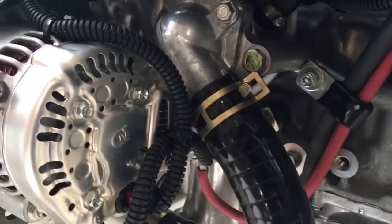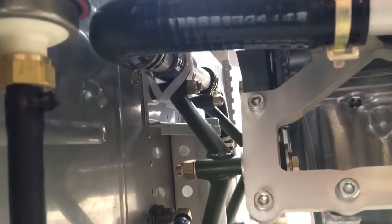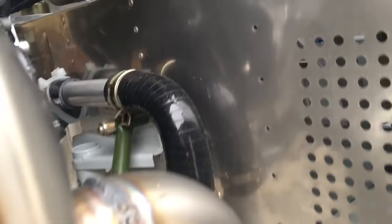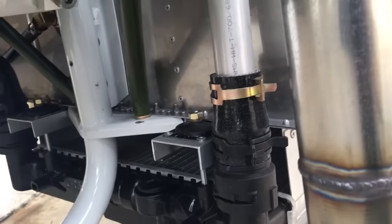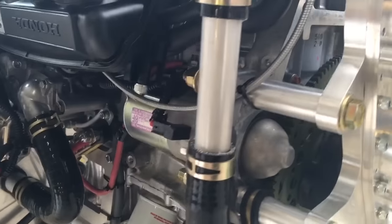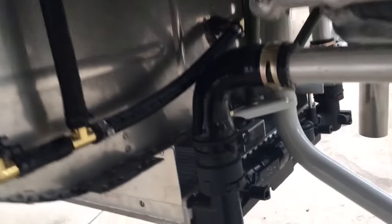For the cooling system, you're going to be coming out of your thermostat housing with a 135-degree elbow, a little piece of aluminum tubing barbed, then a 90, and going behind the engine but right on top of the engine mount. That's one side of the radiator, basically — coming across the top there. Then we make another 90 and go right into the radiator on this side. The other side is the hot side — that's the flow to the radiator — coming out of the cylinder head up here. Put a 90 on that. The 90s come with longer legs so you shorten them down, then a downspout pipe, a 45, another 45, and a 90 going into the radiator.